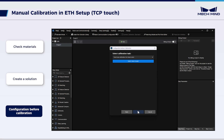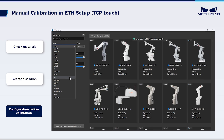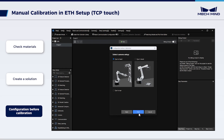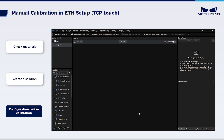Select HandEye calibration for listed robot and click Select Robot Model. Then select the model of the real robot in the software's robot library — this video selects Yaskawa GP8. Select Camera Setup as Eye to Hand. Set calibration method and robot control as manual. For the way to collect data, select TCP touch, then click the Calibrate button.